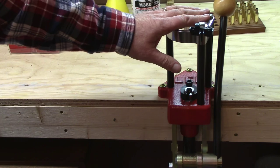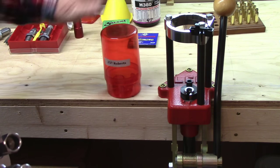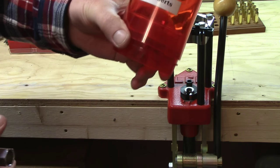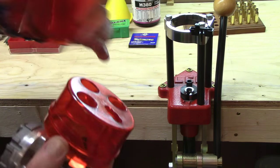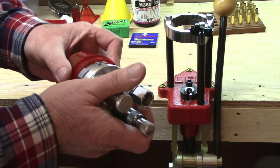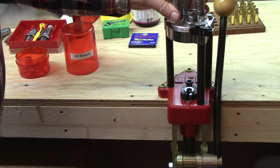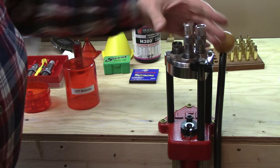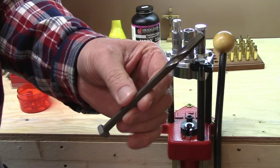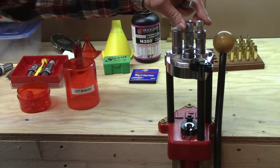This is a nice press I like to use — I've found it to be the handiest press I've ever used. If you get turrets, get these lids — they come to you and you'll wonder what to do with them. They're for storing your dies individually, but if you flip the bottom upside down it becomes a storage case for your turret. Once the turret is in place, you can either index it manually and use it as a single-stage press, or put the rotation mechanism in and it will spin and index it automatically as a semi-progressive press.